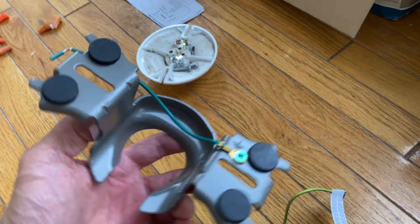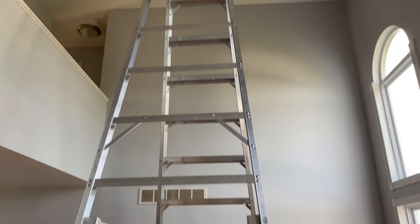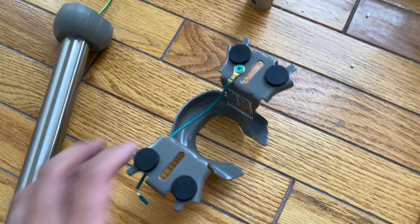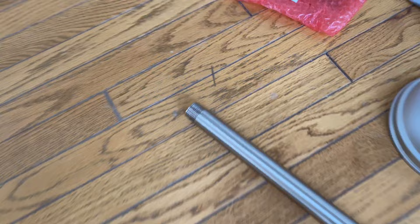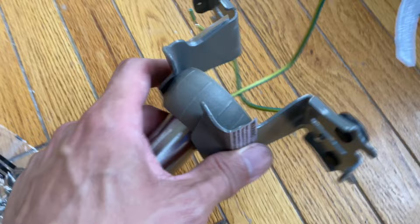The next thing I'm going to do is mount this bracket up onto the box. My ceiling is 16 feet so I needed to use this 14-foot ladder. The way that this bracket holds is you get your motor mounted on there — this is a threaded end which is secured by a set screw, and there's also red thread locker on here. This end goes in here and basically just hangs like that.